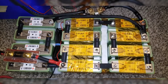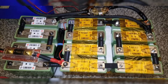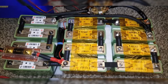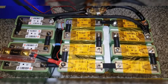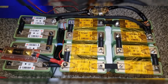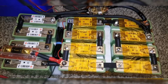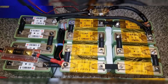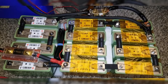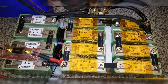Live from the command center of GW Solar USA. Let's talk about my LEV 60F 3.2 volt 74 amp-hour LiFePO4 power cells that I've been working on. I've done some modifications. This cell is 3.2 volt nominal, and the voltage range you can start from 2.0 to 3.5 volts — meaning you can charge this battery all the way to 3.5 volts.